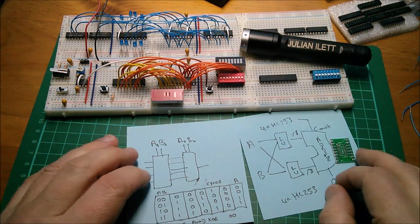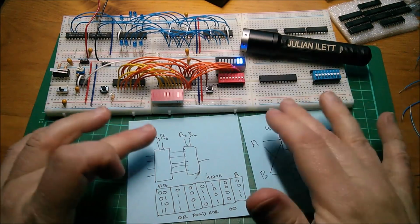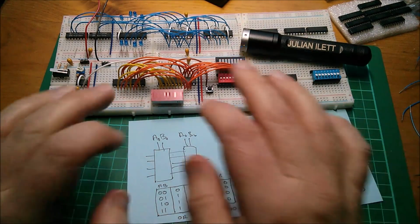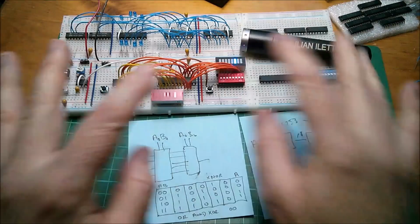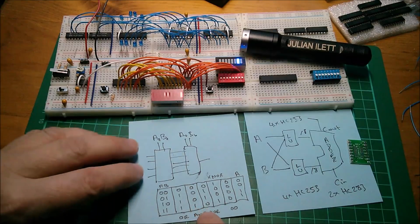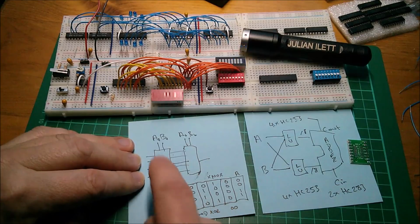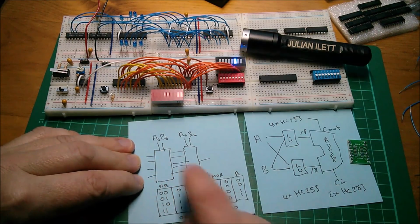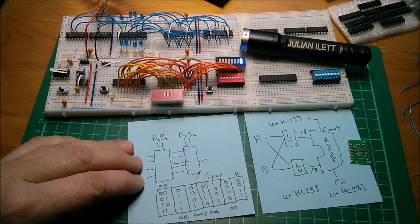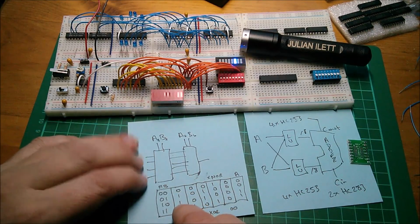Now, I do have one kind of paradoxical situation at the moment, and that is that this computer has no literals. There is only one instruction in here, and it is simply copy from one of these latches to another, and you just do sequences of copying one latch to another, whichever the read and write latches might be. Now, to set up these logical units, we need to put patterns of digits to set up what gate type you're using onto these multiplexer input lines, these data lines, but they become the configurator lines if you're using it as a logic unit. But because I don't have literals, I can't create these patterns to put them on here.